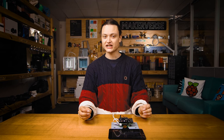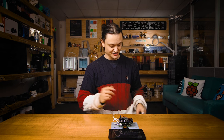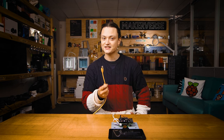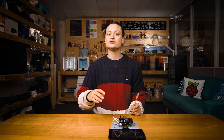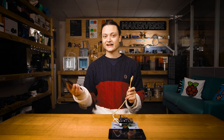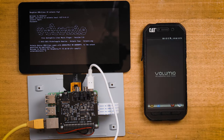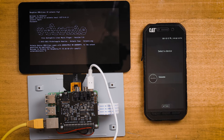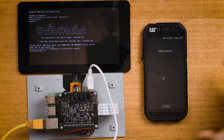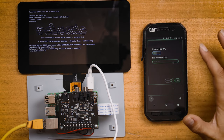The goal now is to provide the initial setup details and Wi-Fi internet details into this system. The easiest way to do this is by directly connecting an ethernet cord initially and then entering these details using an internet browser on a locally connected device, be it a computer or a phone. So let's plug this in and pull out our phone, which has the Volumio app and is connected to the same network. As soon as you open the app, it will search and identify devices on the local network running Volumio. Then it's a simple matter of selecting your language, creating a suitable name for your system, and telling it what DAC you're using — in my case, the IQ Audio DAC Plus.